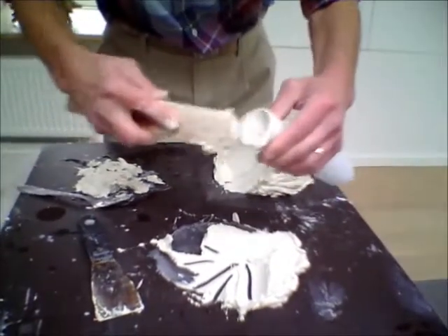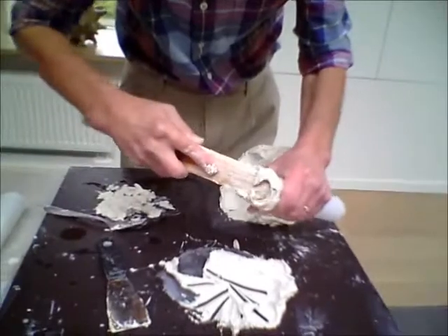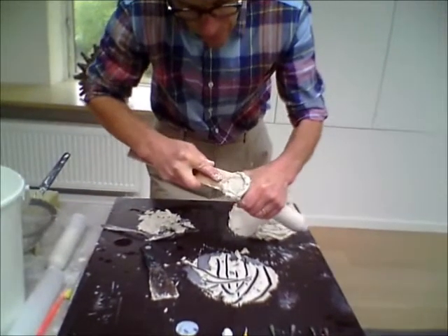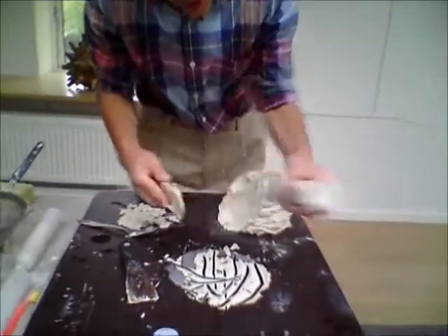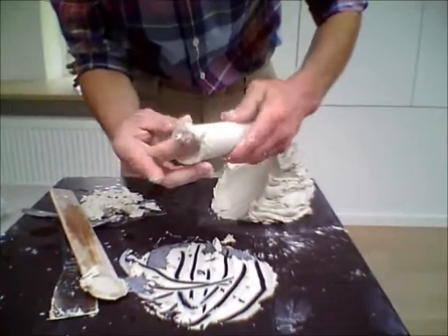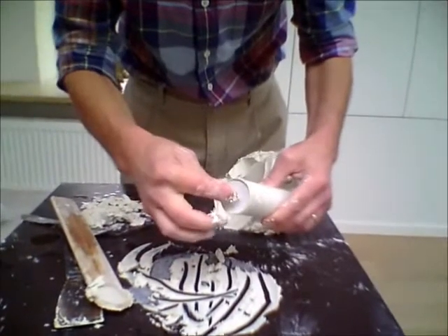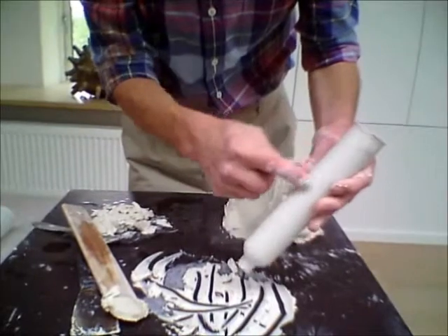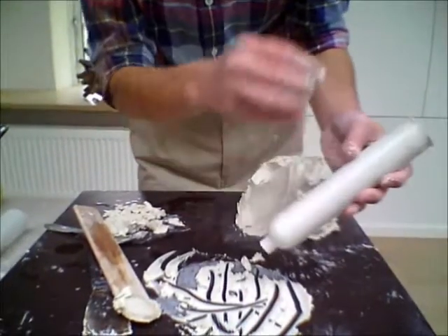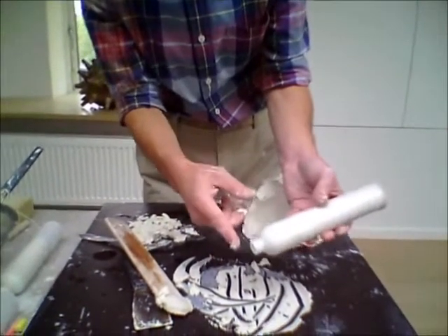So you can see it starts filling quite quickly. It takes a bit more pressure as it goes down to get it pushed and pressed in. It's nearly coming out the bottom — then just take off any excess. And we've got a little plastic plate that goes in the top, because the air pressure is now going to press that down, slowly extruding the clay. From about 2cm down, if you don't have a plastic plate the air just pushes it through. This will take about an hour to print, and after an hour of printing you don't want the air pressure to then blow over your print.